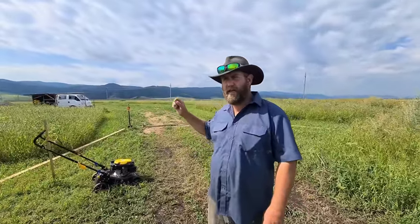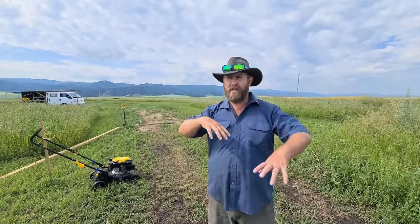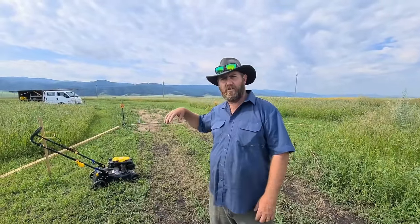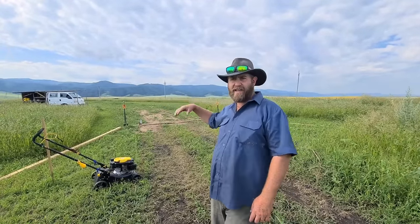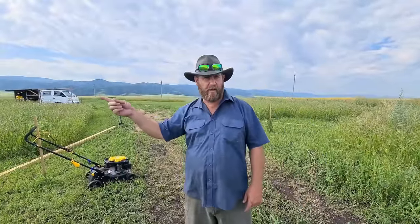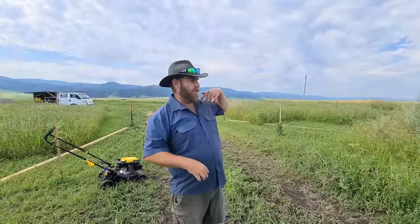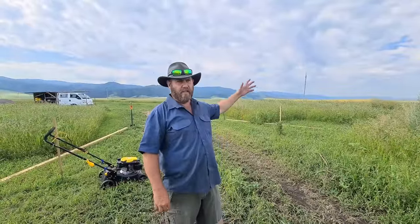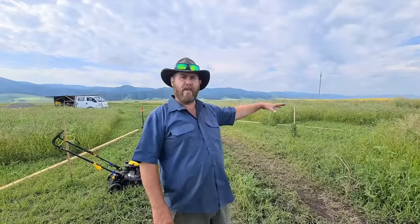Alrighty guys, we are right at the front of our property. We are just prepping for where we're going to be doing our front entrance gate section. So we're doing some marking out to make sure that it's in a good spot in relation to the house and for accessing into the sheds and the buildings. We've already set our corner units, or marked them out, so where we're going to start drilling. And so we're concentrating right now on just marking out where all our corner strainer units will be set up, and from there we go and then put the rest of the posts in.